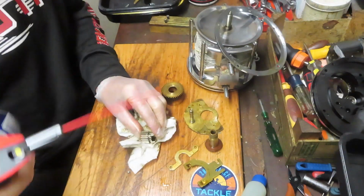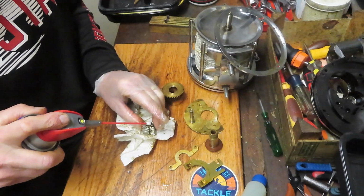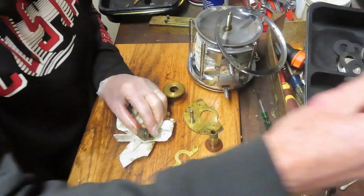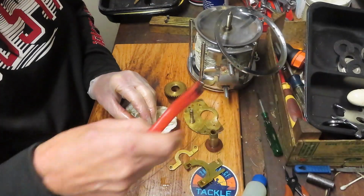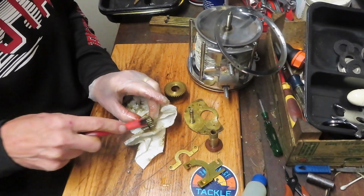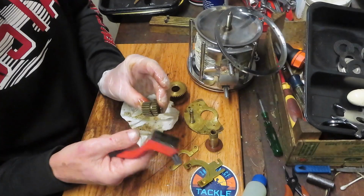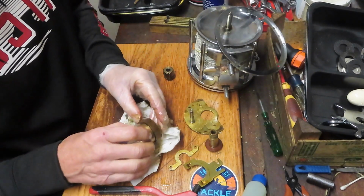And then on the gear teeth themselves, and you can see these are huge. This is major machinery here. I'm going to grab that, and I'm going to grab a bristle brush. I'm going to pull through to make sure that the gears are clean. You don't want any obstructions in the valleys of these teeth. And while you're doing this, you want to check to make sure that the teeth are perfectly aligned, that they're not bent, chipped, scarred, or in any other way deformed.